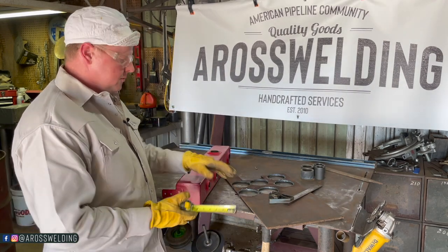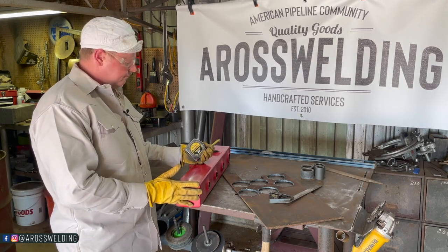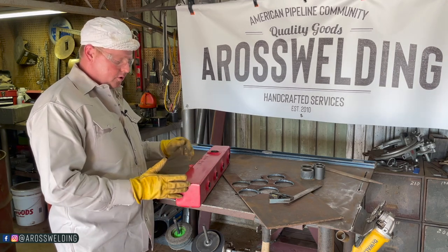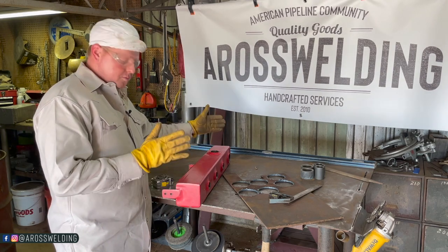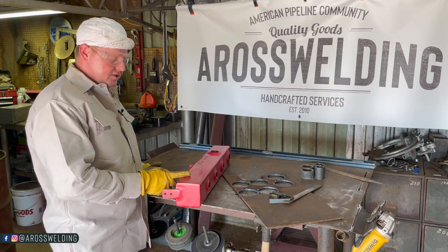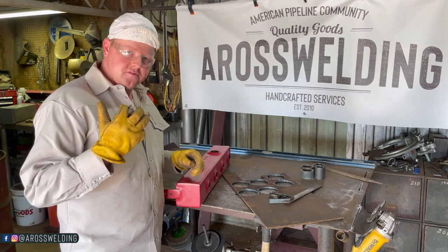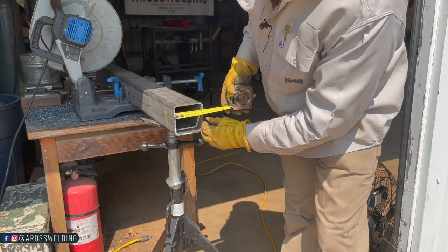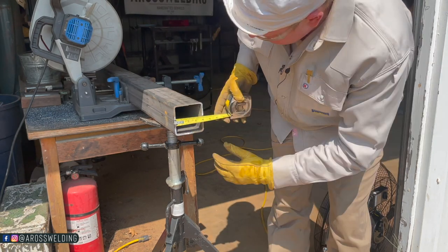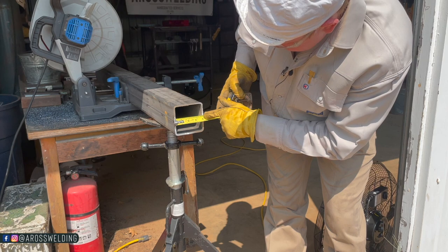So what I was saying was, since my caps are going to be going on the end of my square tubing, I gotta make my tubing 1/2 inch shorter, so my final measurement will be 26 1/2. So I'm gonna cut my tubing to 26 inches and then cut two caps at whatever measurement we find out over here. Obviously our OD, our outside dimension, is 4 inches. But I'm going to go from outside to inside, which is about 3 7/8.